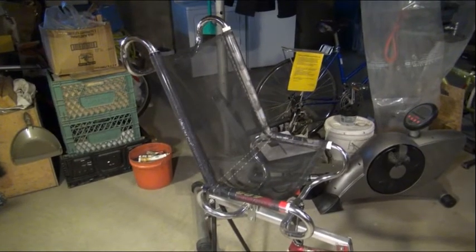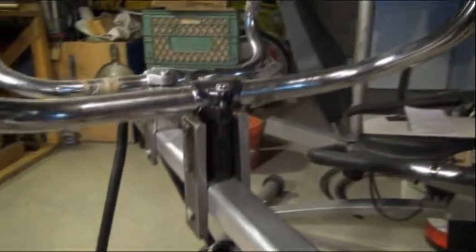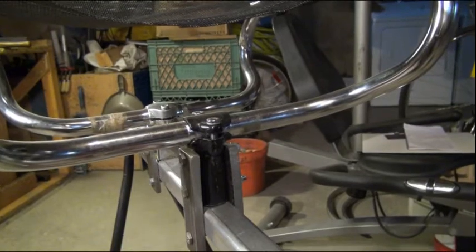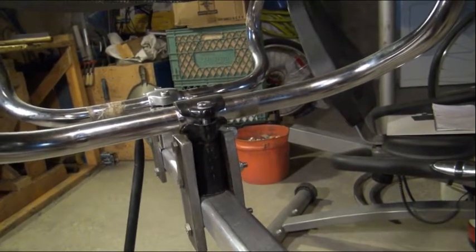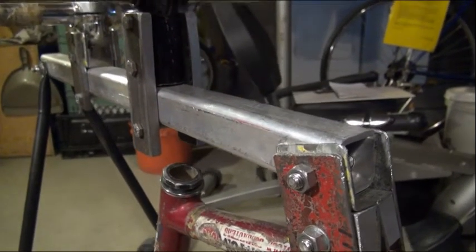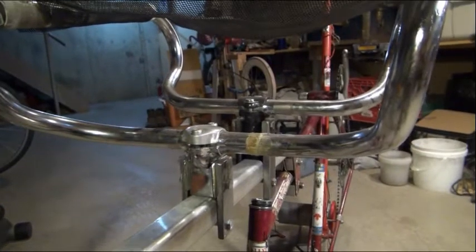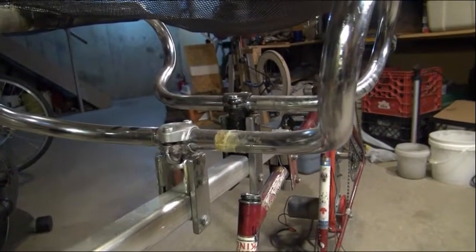This is how I've attached the recumbent seat to a device, using a square rail. I've used stem clamps to hold the handlebars — serving as cross pieces — down onto the rail. The clamps are braced with two thick steel plates that have been bolted through the clamp in two spots, and then one spot below the rail, which when loosened allows the whole contraption to slide back and forth along the rail. In the back, the stem clamp happens to be a little narrower, so I've used shims to prevent it from locking onto the rail permanently.